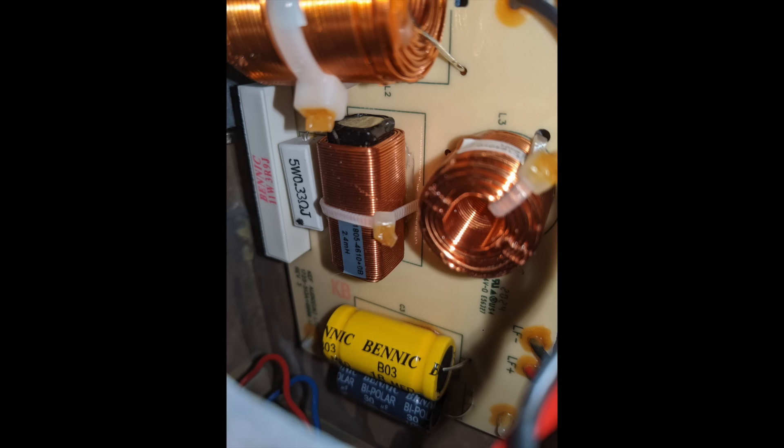Now, that being said, on the woofer circuit — why did they cheap out? The woofer circuit has some cheesy parts: a couple of small air core inductors, an iron core inductor, two sandcast resistors, and the capacitors are electrolytic capacitors. If you're listening and notice a somewhat veiled sound, or the vocals are a little soft or subdued — playing through a wet rag, not really open or lively — that's probably the culprit. Those types of parts produce that type of sound. They used them in the woofer circuit but not in the tweeter circuit.